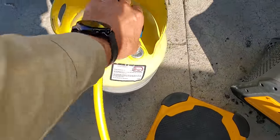So that presents some problems. Obviously, this wouldn't work in a really high humid environment. We don't have much humidity here in California, okay? This is in the desert, actually, but they have a lot of heat. It's very dry, so it leads to issues. The filters get plugged up really quick because they're pulling in outside air full of sand. Then you're basically cooking the oil in the compressors. I believe that's why the filter dryer plugged up, and I believe that's why the expansion valve had goo in it, because the oil essentially turned into sludge in the system.